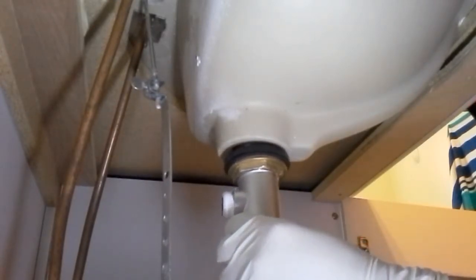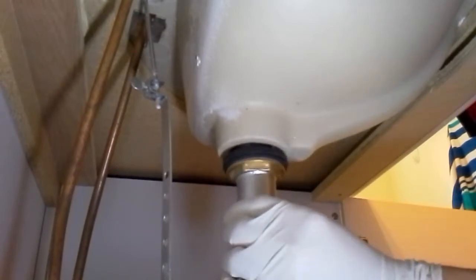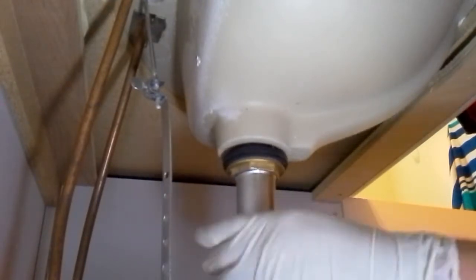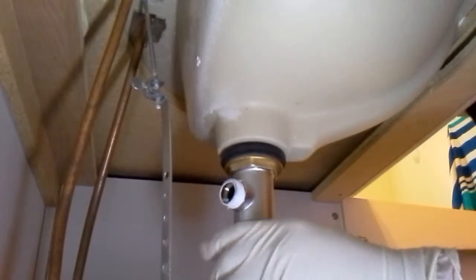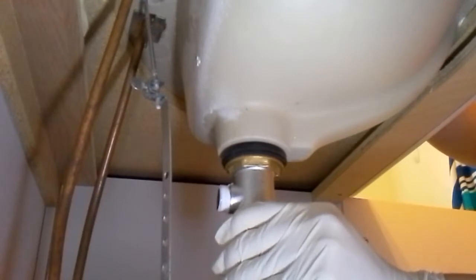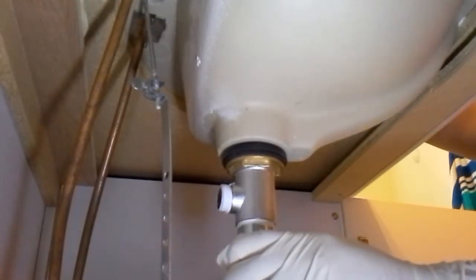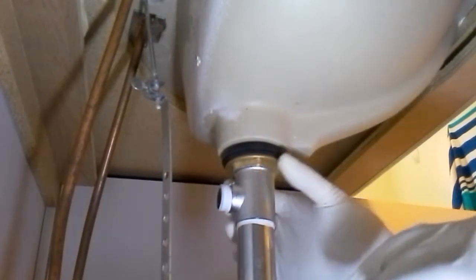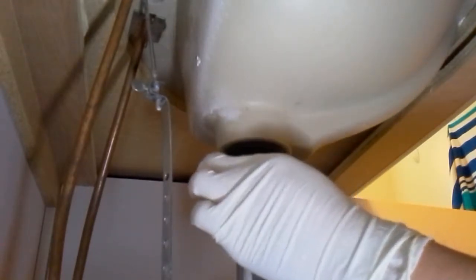Alright, there you are. I should have tried the dry fit first. Oh, it's connecting, good. Alright, so up above, that's good. Kind of tight on the bottom. And aim to the back. Now, I don't have any wiggle room, which is good. I have a lot of putty up above coming up. Looks good here, so what I'll do is I'll tighten up the nut towards the sink. Hand tighten first, and then I'll finish with the wrench. Everything looks good.